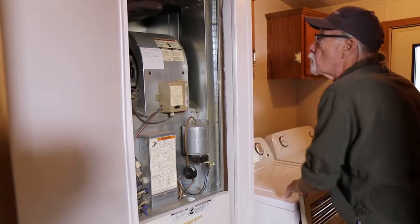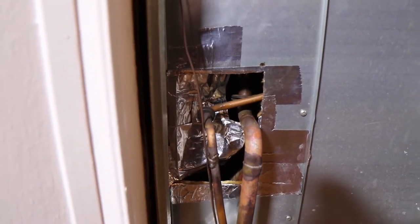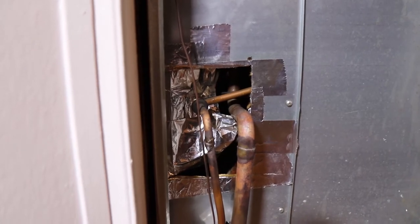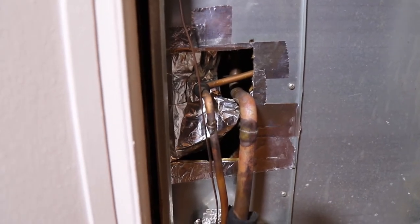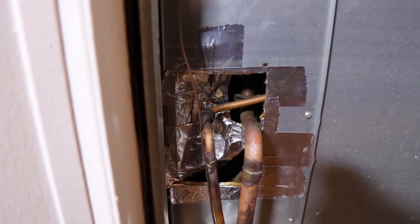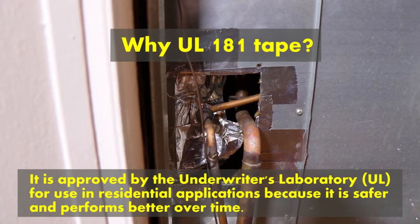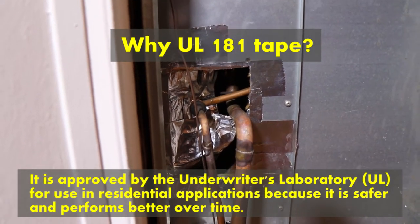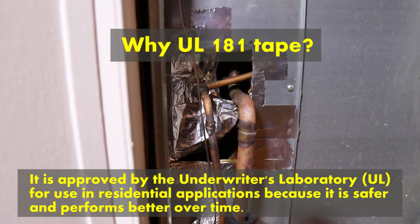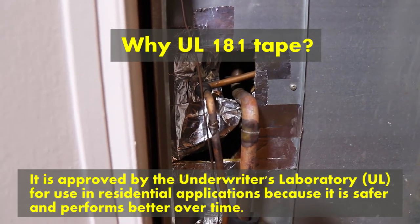Here I'm taking a look at the different components. Looking at the bottom part, I notice a large gap around the A-coil access point. Areas like this need to be sealed up. That hole can be covered up using silver-faced duct tape, UL 181 rated. This is something your furnace technician can do, or go to your hardware store and ask for the foil duct tape, UL 181 rated.